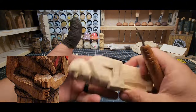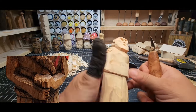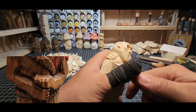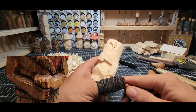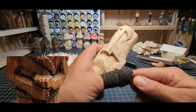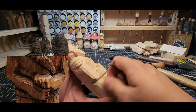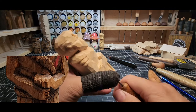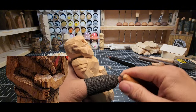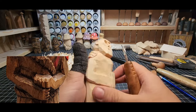All right, so we're just going to round off that elbow there and we're forming these arms a little bit at a time into the shape that we want, putting a little more detail into the top of that bicep along that curve we drew. Round out that thing with a little crease there in the corner of the elbow. Round up the top of that forearm — pay attention to your wood grain and make sure you're carving the right direction for that piece of wood in that section, so you don't tear wood and have big chunks come off.